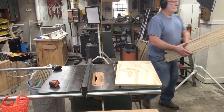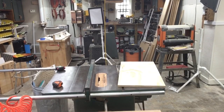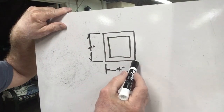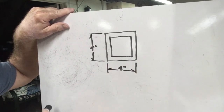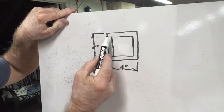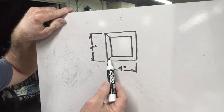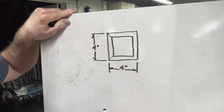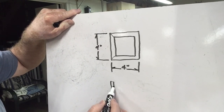I'm going to cut enough of them so that I'll be able to do this all at one time, and I'll have a little bit of plywood left over. To make this 4 inch by 4 inch post for my table leg, there are several different ways I can do the joints. One way is to cut it on a 45 degree angle and nail them together with glue, but I really don't like that type of joint — to me it's just not strong enough.